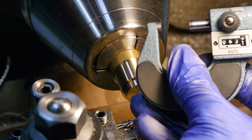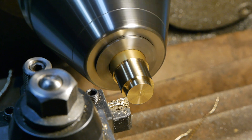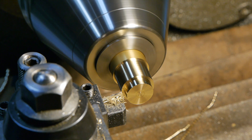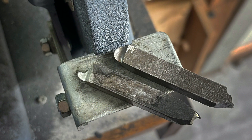That's really close, and with another light pass it'll be right on the money. On the bench grinder, I modified a couple of high-speed steel form cutters left over from other projects. Basically it's a cut-and-try method, shaping the tool by hand on the grinder and frequently checking it against a sample knob. Neither shape is a simple radius, and I think I got close enough so that one would have to view the original and replacement knobs side-by-side to notice the difference.